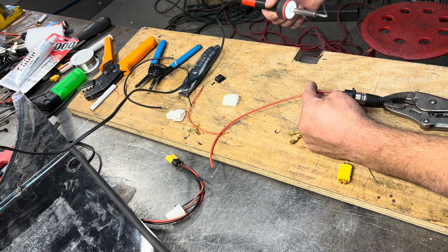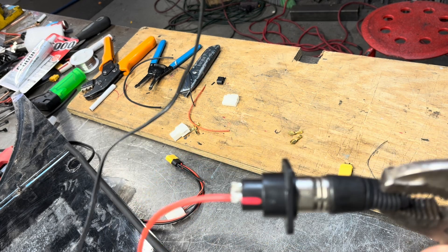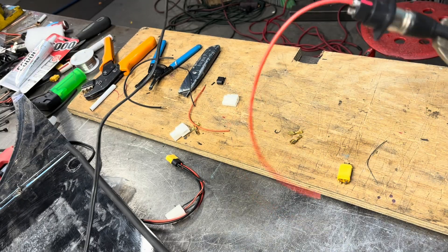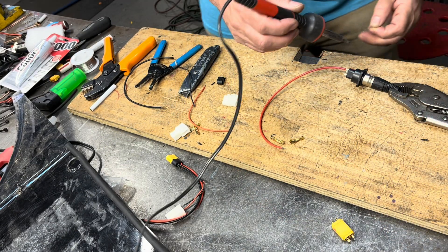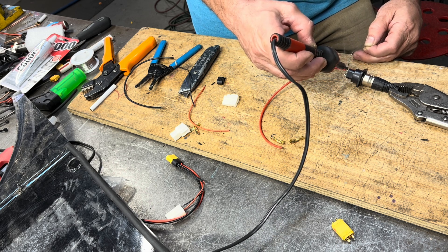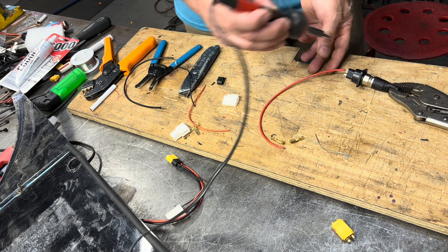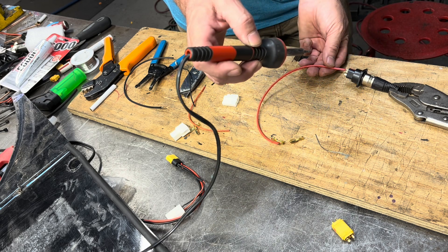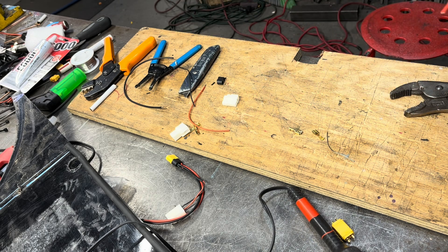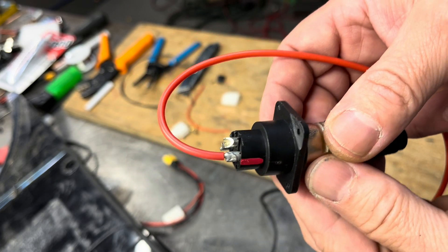Once that cools off a little, you just want to solder, let it flow around a little bit on each side so the wire doesn't pull out later. I'm going to do that real quick here — sorry about the camera angle, that's the best I can do right now. I want to put enough solder on there so it flows nice. It's better if it wraps around a tiny bit — that'll definitely hold it in place.